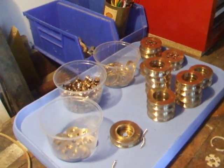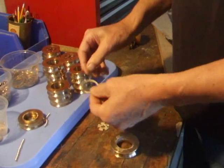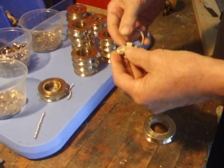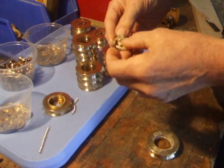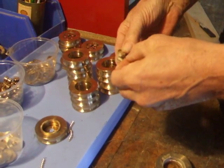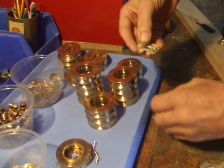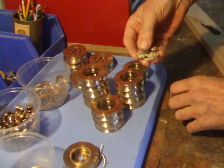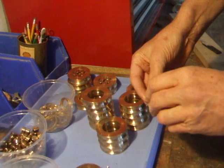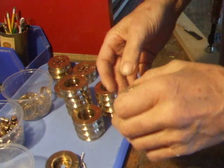As we see here. And here's how you do it. You get a snap ring, and that washer, and it goes together like that. One. Two. These have a light coating of grease to help them go together. Four and five. And that makes a little assembly that tends to stay together.